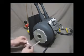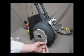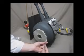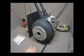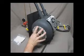Now to finish off the chamber, literally just go around it, inside and outside, just by shoving in the K-wool, and this creates a very, very tight seal. Well then, the firewall has been inserted. As you can see, it's done very neatly, both the outside as well as the inside of the forge, securing that firewall in place.